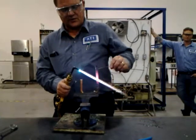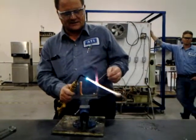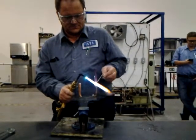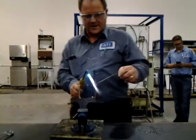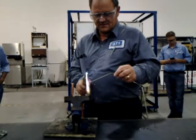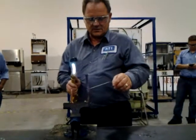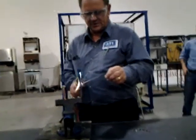Now, brazing rods. People lay them in there like this sometimes initially. They try to like dab it. No, not like that, okay? Because when you do that, here's what will happen sometimes. Yeah. Because it'll partially melt and it'll stick. They're like, oh crap, what do I do? Okay. Well, you got to heat up a little bit, okay?